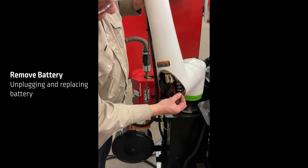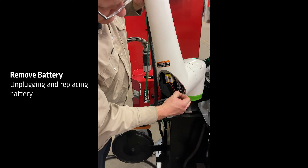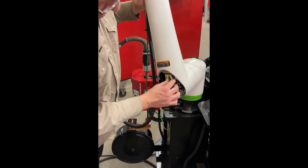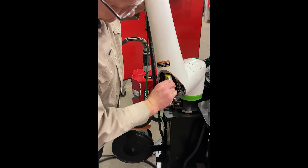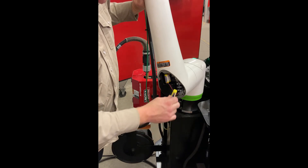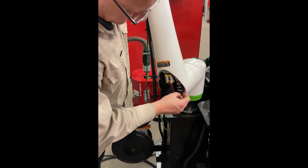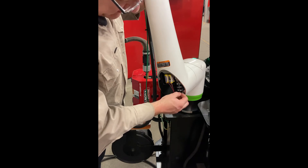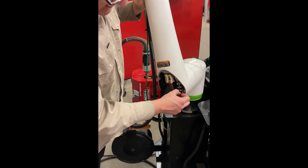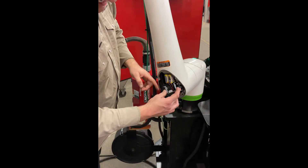There's a little plug right in here. I'm going to push in on the tab and pull that plug straight out. There are little plastic C-clips that are holding these battery packs in place — you just pull it straight out, put the new ones in, and then reverse the order. Plug it back in, making sure you hear a click so you know it's positively connected. Give the plastic plug a little tug — don't pull on the wires. Now I'm ready to put the cage back on and just reverse the order.